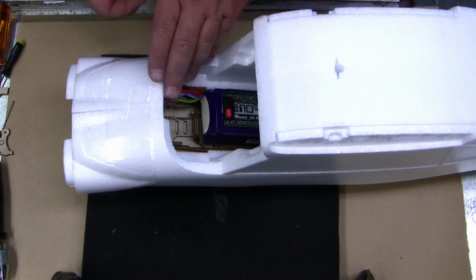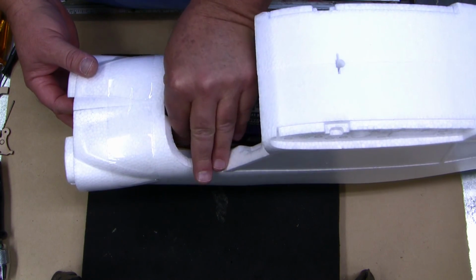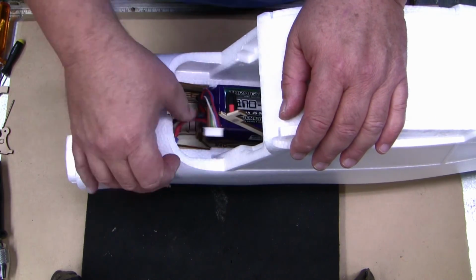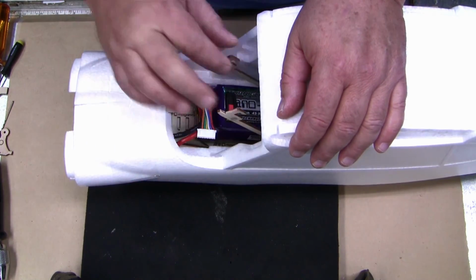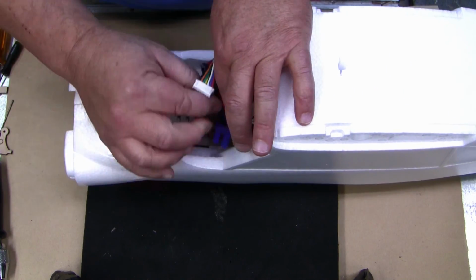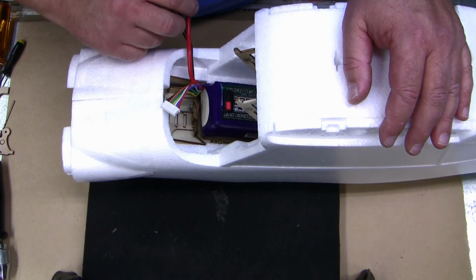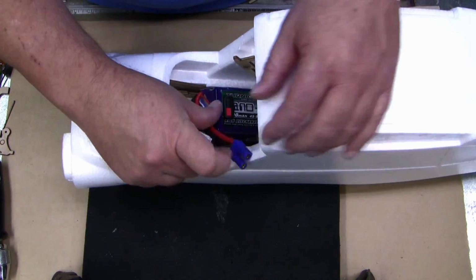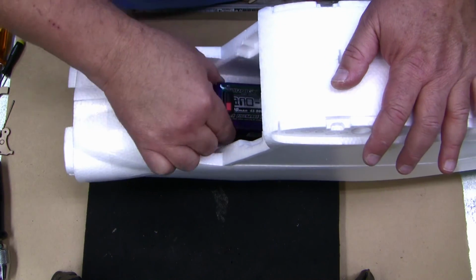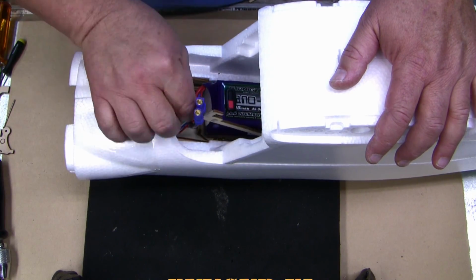To get it out, you pull the pawl, this little handle on the pawl, in towards the aircraft and up. Same on the other side. In and up. Clear them that way. Pull the gate up, and out it comes. Just like that. Slide it in, slide it between, pawls down, gate down, most critical. And there you are. Gate up, pawls up.